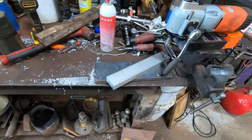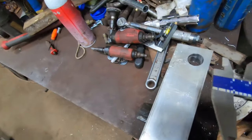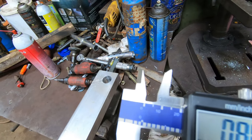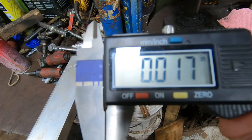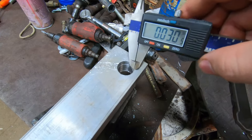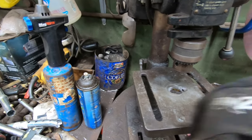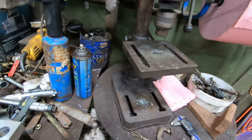That makes quite a mess for just one little hole. Alright, so we've got to get this hole a little bit bigger. That rod measures 870 thousandths. Let's measure the hole we got — it is 809. So that means we've got to go 61, let's just say 60 thousandths. So we're going to go 30 on each side. I'm going to score around there and make an outline around the edge. Then I've got an end mill — I'm going to try to put the end mill on the drill press and open it up that way instead of the burr, because then at least within the drill press it'll kind of keep it straight.